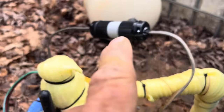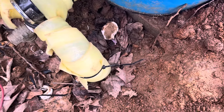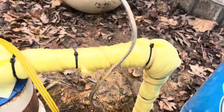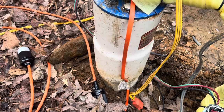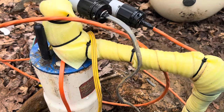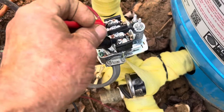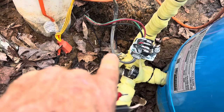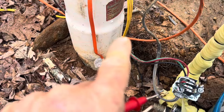We put that plug in the wire and got it hooked back up. So now I'm going to take the voltmeter, go between the two hot wires, and I've got 246-247 volts — so we've got power back in there as usual. We then unplugged the well, plugged the extension cord into it, and checked to make sure that extension cord's wired correctly. Going from the hot side of the two sides of the switches, we're back at 246 volts, so everything works right. We'll find a hose, turn the valve on, let some water run, and make sure the well's working.